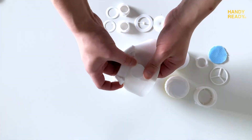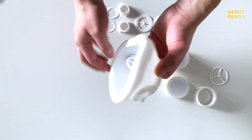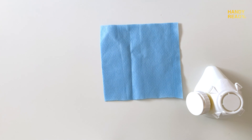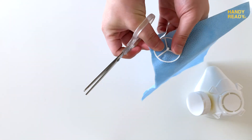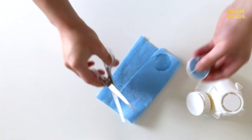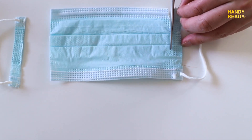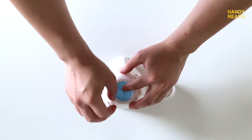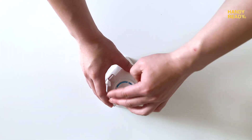For those who wanted to do a simple setup, twist the outer adapter seal for both sides, then put the filter inside the core. In terms of filter, I've used a cutout from a sterilization wrap as it is 99% BFE. For those who have no clue what a sterilization wrap is, you can check out my previous video linked below. Another alternative is that you can cut out from a surgical mask. I don't really recommend using cotton pads as a filter, as it doesn't have a high enough filtration. Once the filter is in, put the filter backing to secure and flatten it out, and lastly twist the cover to finish up the assembly.